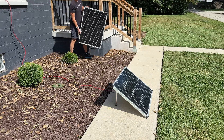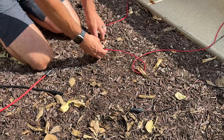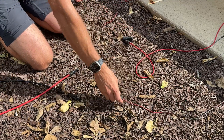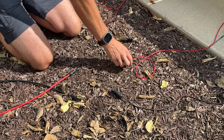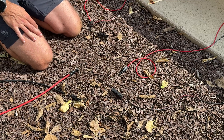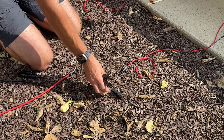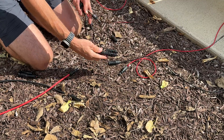Let's go ahead and bring out our second 100 watt panel. It should be said we would always prefer to go series if we could, just daisy chaining these panels together and then bringing them into our extension cables. But series will add up your voltages — in this case that would be at least 32 volts, and actually the open circuit voltage would be much higher, into the 40s. That would be well over the maximum voltage for the EcoFlow, which is right at 30 volts, so we can't do that — if you go over the voltage limit it shuts everything down. So we have to go in parallel, and you can get these little Y-splitters for that.